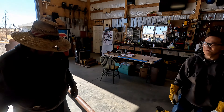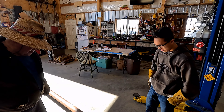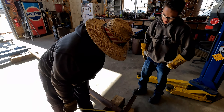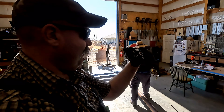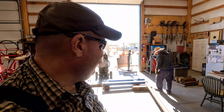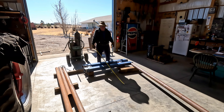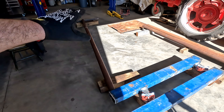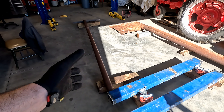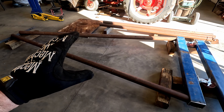You and David just checked this — what are we? We're right on our 11 foot 7, right on the money, and our angles look beautiful. 12 foot 6, right on the money. So the top of the beam will be 13 foot 6. That arm's cut. We're going to do the rest of these off camera. There's our second one that's cut. Our angles are working out perfect. We're going to cut the other two and get that laid out and ready.